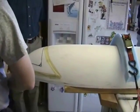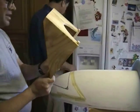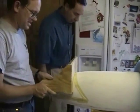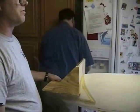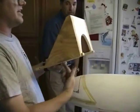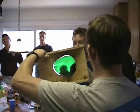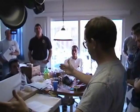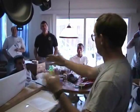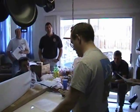That's where the PDA comes in — not your personal digital assistant, but the Pusher Do for Assembly, which is basically set up for the right thickness of plexiglass to fit right on there. This goes around the outside edges; you'll note it's bigger than the part. That's so that it's not right on the part itself. If you just did that on a piece, you'd find that it had shrunk in dimension by about 2%, and correspondingly got just a fuzz thicker as a result.